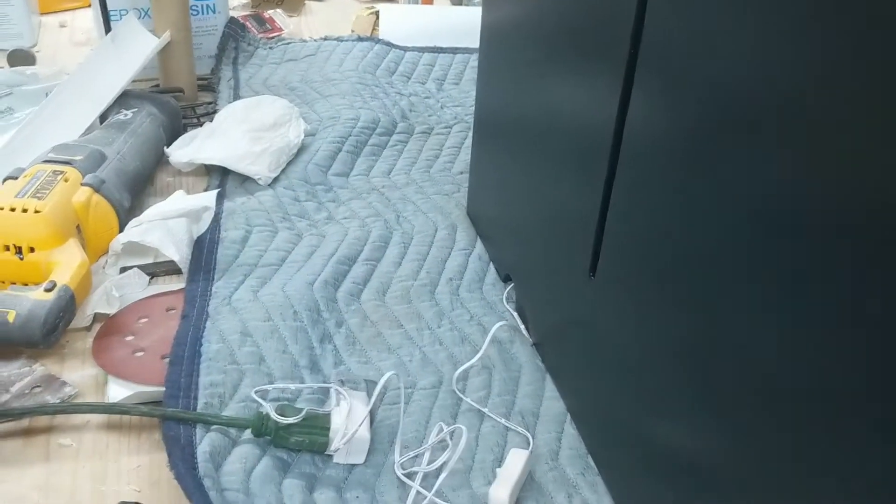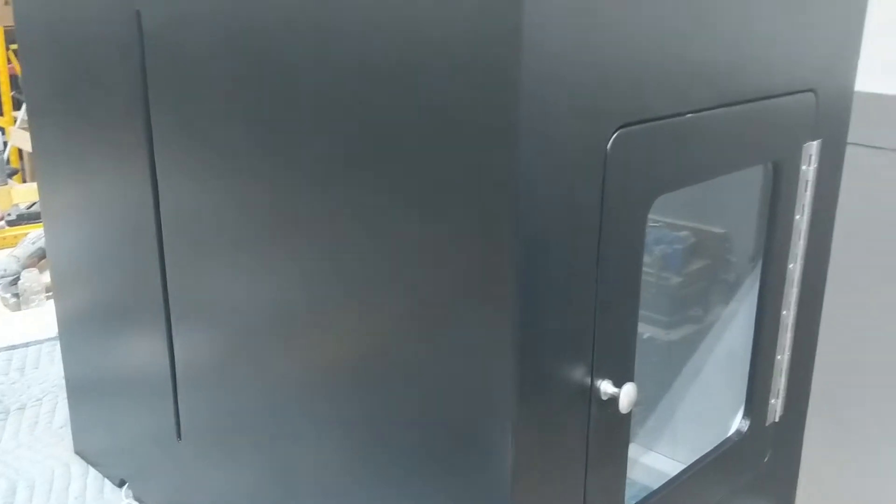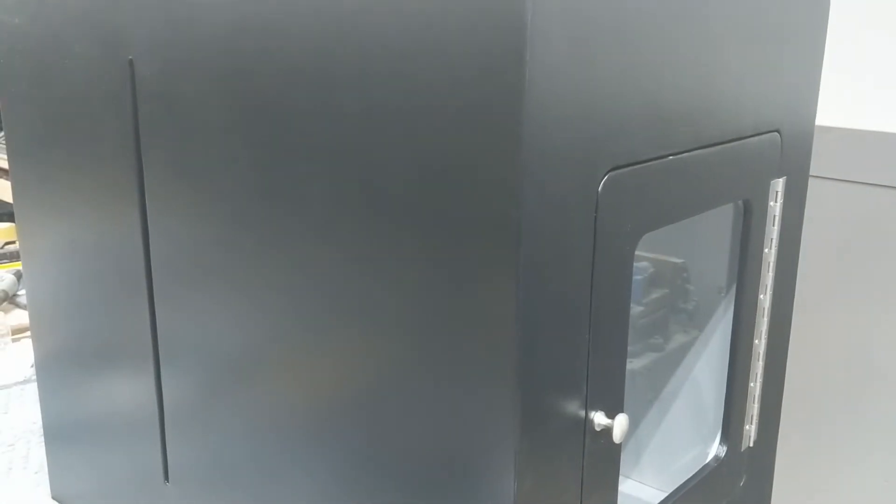My box is all painted and I'm happy with the way it came out. After putting on the mud and sanding it flat, that helped get rid of some of the grain. I did two coats of drywall primer and four coats of semi-gloss black Rust-Oleum. After the first coat you could see a lot of white, the second one was mostly covered, it was good to go after the third, but I did a fourth coat just to help hide some of the grain a little better. You can see it's not perfect — if you look closely you can kind of see some grain lines — but it's good enough for what it is.